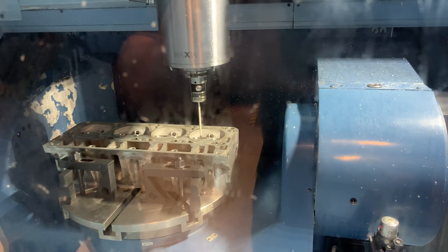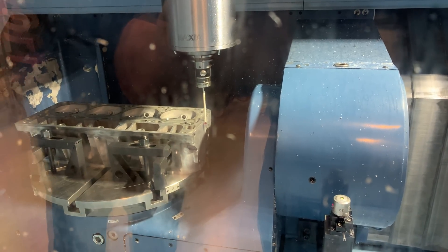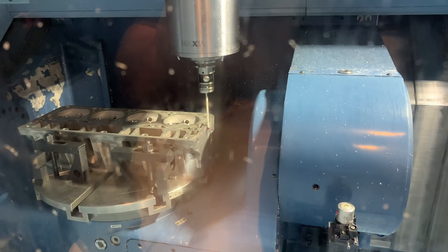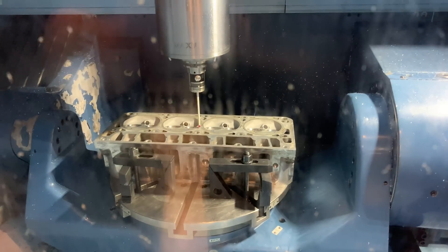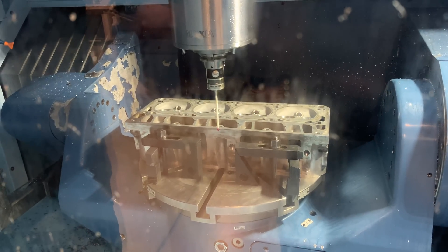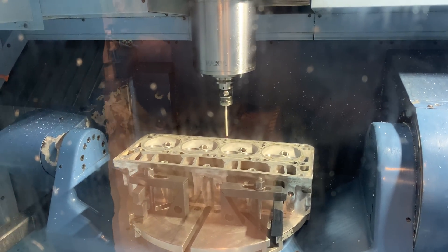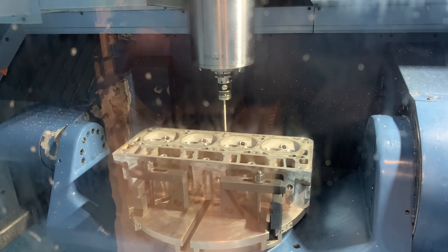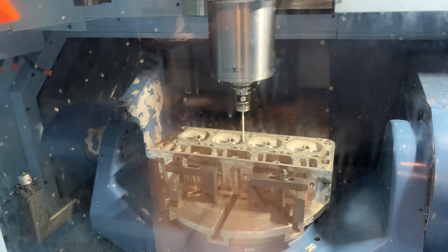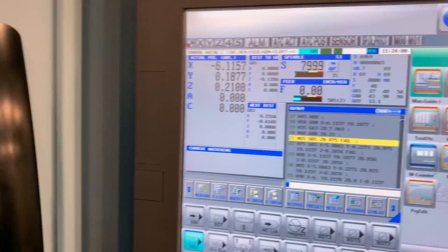Instead of physically touching off the machine, I can tell the probe to find center. That side is flat, so the other two sides are more relevant — I'll go a little lower on those. We got our X, and we're going to do the same thing for our Y. Machinists nowadays don't even have to get dirty. We already probed our Z which is the top surface.